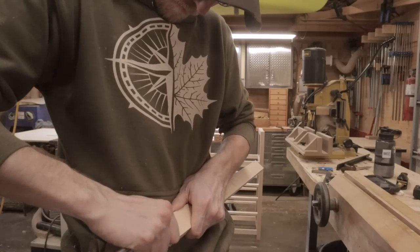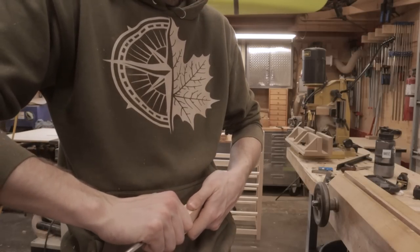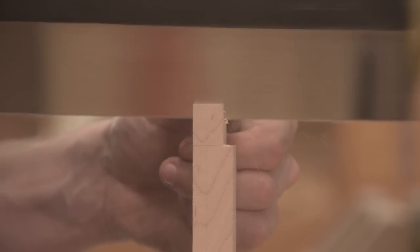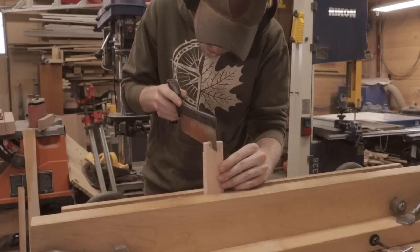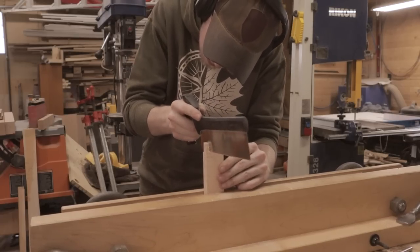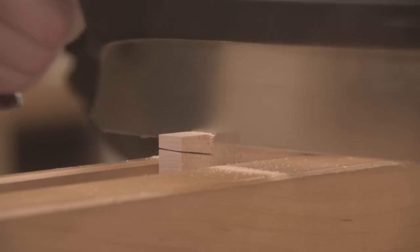And the final piece of the cross structure is our top stretchers. Now whenever I'm doing post legs, I always do my top stretchers with half-blind dovetails. This just helps prevent the top portion of whatever it is you're building, whether it's a dresser or a table, it doesn't really matter, from pulling apart, because you have that mechanical advantage of the joint to help hold everything together.